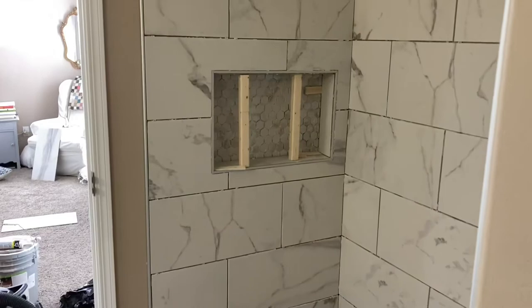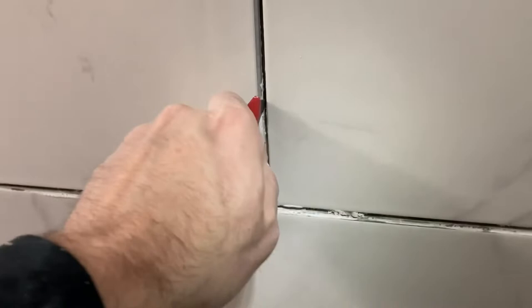Here's a look at the shower — the tiling is up and I'm ready to grout. First thing: get your spacers out, and if you have any dried thinset left over from tiling, make sure that's cleaned up. The smart person wipes it off when it's still wet, but even if it's days dry, a wet cloth should rub it off reasonably well. Use a straight-edge razor blade or utility knife to get rid of any stubborn bits.